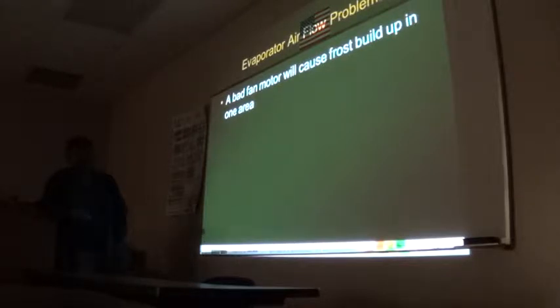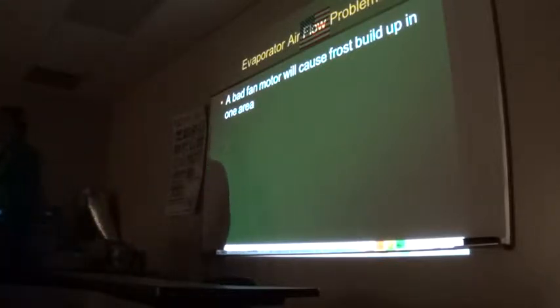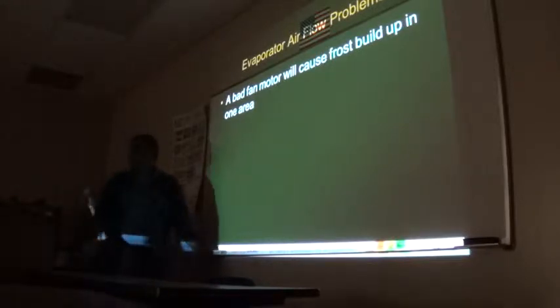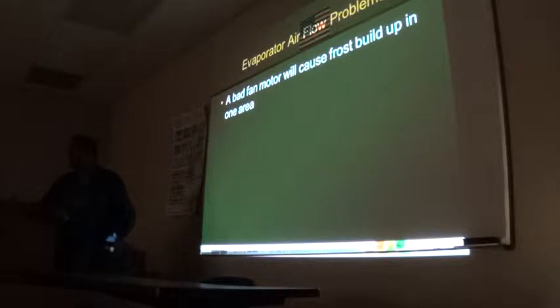So what will happen when I begin to form ice on the evaporator? What happens to my suction line? Pressure drops, temperature drops, the suction line begins to freeze up, and it begins to creep right back to the compressor. Once I frost up the suction line, chances are liquid refrigerant is going to go back to that compressor. It went all the way from his attic, outside, down the line, straight to the compressor, frost. Sometimes it will encase the whole compressor.